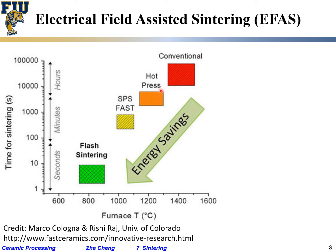Of course, you can do so-called HP or hot pressing, which means during the sintering, at the same time you apply some external pressure. And here, with that help, of course, you can decrease your external or ambient temperature from 1400 roughly to 1200. And your sintering time decreased from 3 hours roughly to, well, 1 hour, something like that, or even shorter. Make sense? Because your driving force not only comes from thermal, now also comes from mechanical.